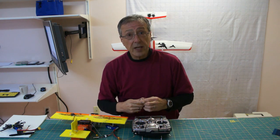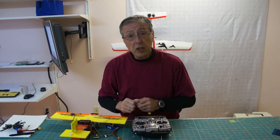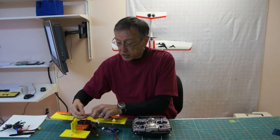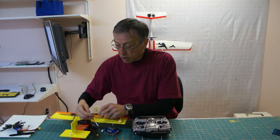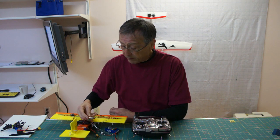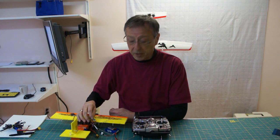Make sure your offset is set to zero and you're just dealing with the voltage. You'll also find in the documentation that there are different dividers, and that depends on where you've actually soldered the positive lead onto your board. Since I'm using a two, three, and four cell battery, I find that the default six-to-one divider works very well for me.